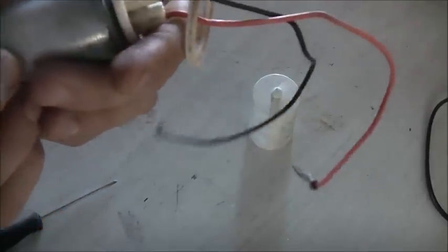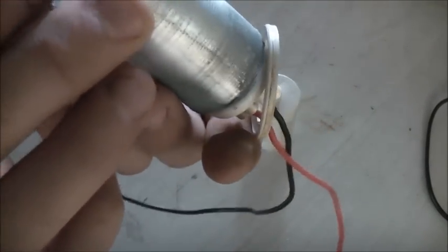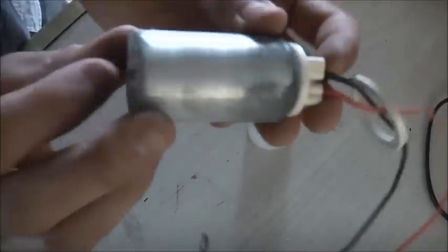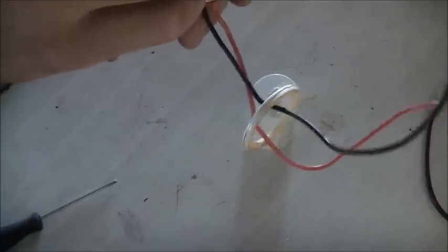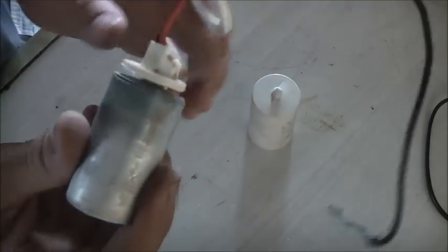You can see the plastic polypropylene - it's wrapped and metallised, very tightly wrapped and wound. There's a wire going out there that goes through the middle to your neutral side - that's your neutral connection. The active looks like it's halfway through. Probably damage from the corrosion on this capacitor - that's why it got so warm. Probably partially shorted.